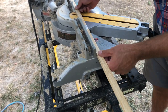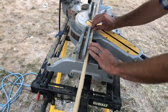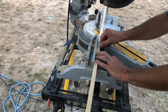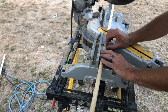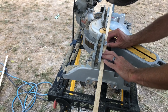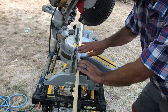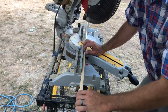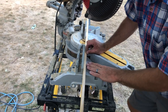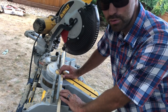Say this is your wall and this is your ceiling. When you're making your marks, you make them on either the ceiling or the wall, but most of the time you want to make it on the ceiling so you can see it and get a good proper cut. This is your wall, this is your ceiling, and you've got to cut it that way — otherwise it's not going to work. If you cut it in a flat 45 it's not going to work and you'll get frustrated. That's just a quick easy tip — pretty simple.